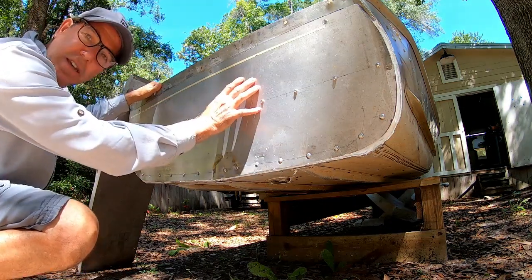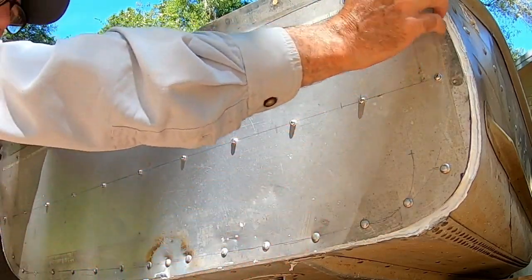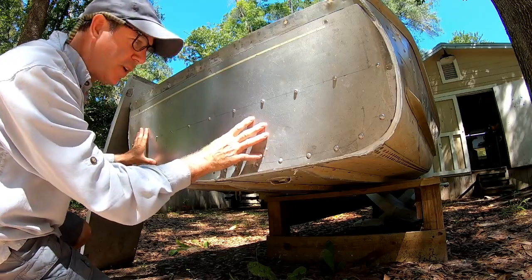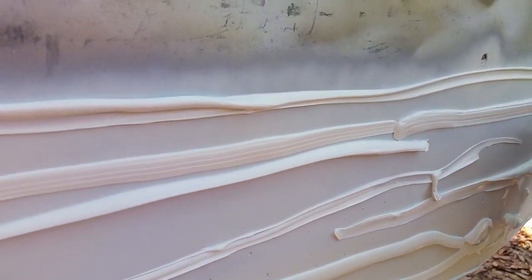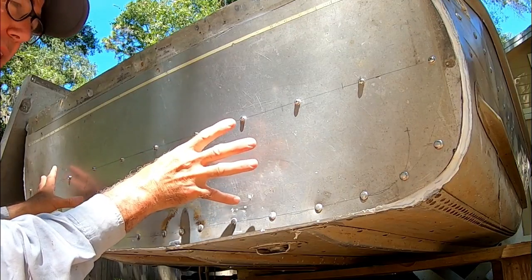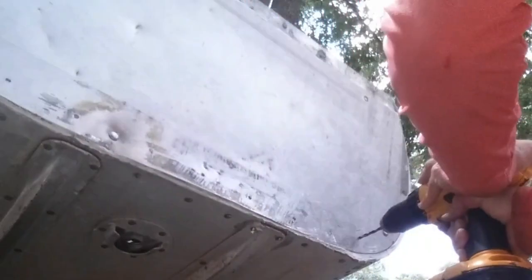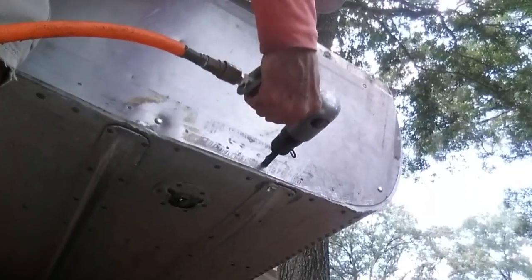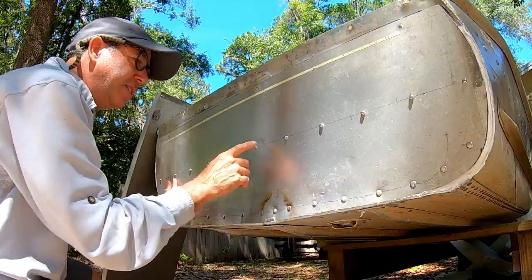So I took the other piece of aluminum that was the bench, and I cut it to shape inside the weld bead. I coated the old transom with some good primer. And then I put this on top of a layer of marine sealer, that 3M stuff, and that stuff takes like 3 weeks to set up. But so I applied this over it, putting these rivets on.